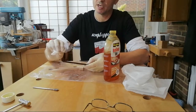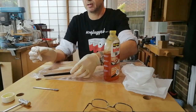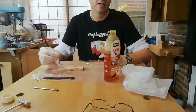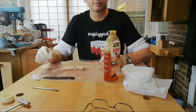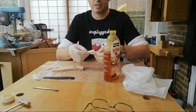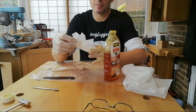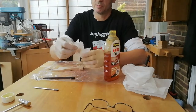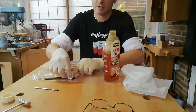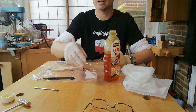This is taking a long time with the wedge because I'm trying to protect those couple of surfaces. I'll just leave that for five or ten minutes and then rub off all the excess, leave it again for perhaps an hour or two, and then give it another application to see if it wants to soak in any more. Notice on my little cloth here it's dark — it's picked up a bit of stain from the African blackwood, so I don't want to use that directly on the beech body.